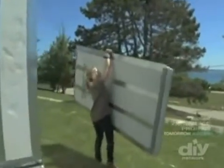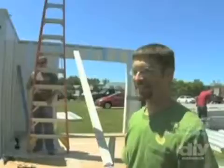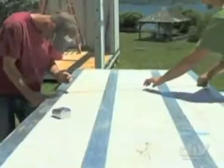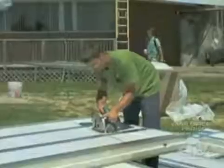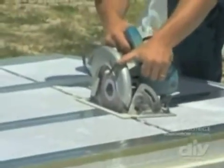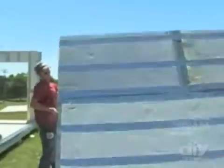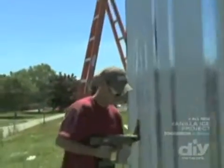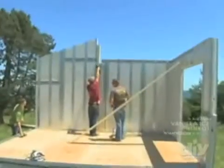That's not bad — even I can lift it. It's really light. That's awesome. Now we're beginning to build a gable, using standard-sized panels and cutting and shaping them to create a beam pocket to support the pitched roof and a beam pocket to support the flat roof. These panels can be modified on-site, so you're taking a stock piece and making a custom build with it, while keeping your costs down.